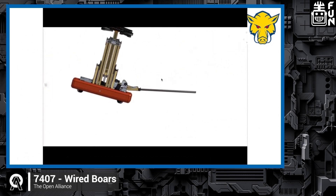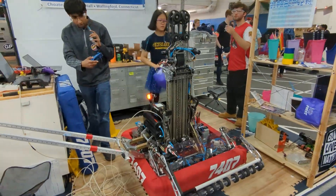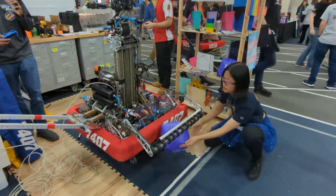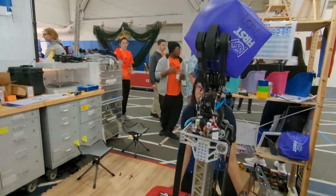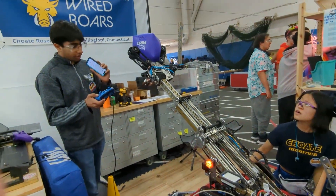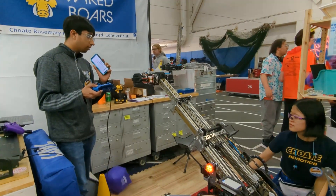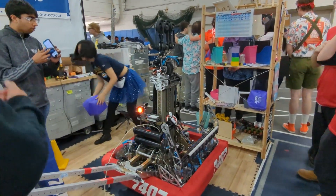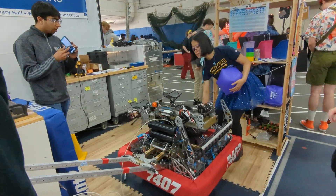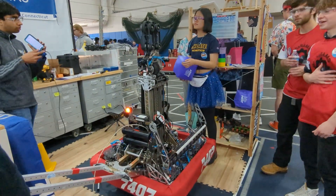Can we see this thing in action? First I'll demonstrate the cube intake. It can come down without the arm to just grab a cube for low scoring. But we can also bring our entire arm down to pick up with the claw. Then we can extend once we have the game piece — for example, to mid. Once we're there, we have operator controls for setting up the scoring and dropping it off. We have different positions for mid and for high scoring, a low scoring position, and also picking from the double substation. It can do all of these from either side — if we rotate the robot, it does it from the other side.